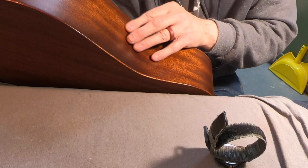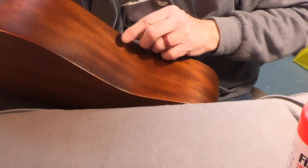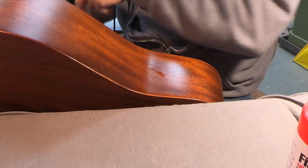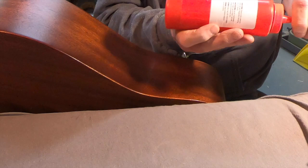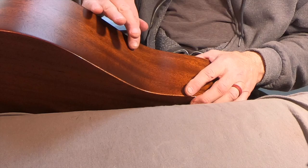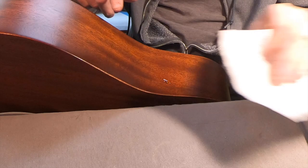I'm going to zoom in a bit. I'm going to dampen this up a little bit - it'll probably fight me because it'll swell the wood, so just a little water in there, very little. I could get this all lined up dry, put magnets on it, then run superglue into it - that would be a valid fix, especially if I'm going to put cleats on it. But I'm going to put some fish glue in there and thin it out a bit.